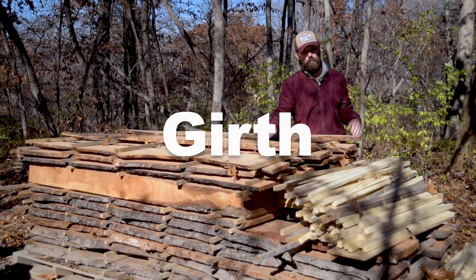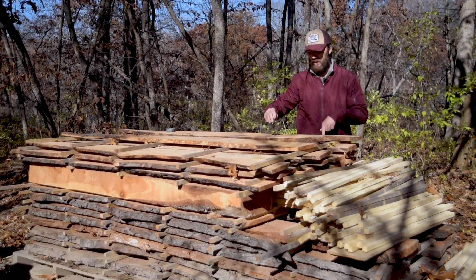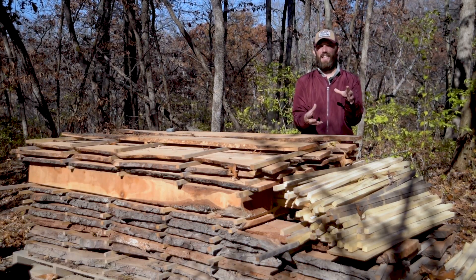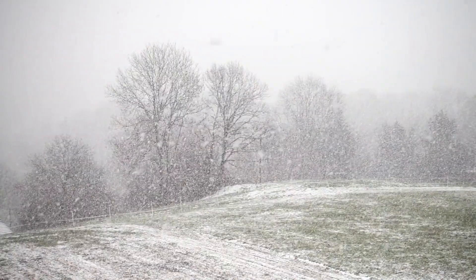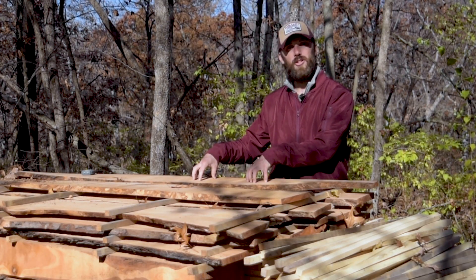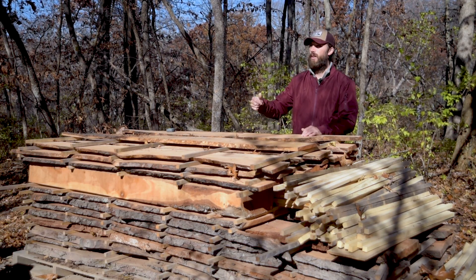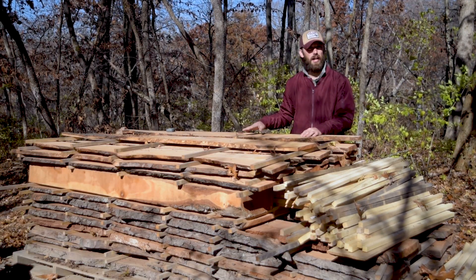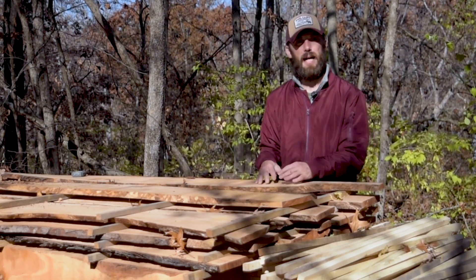The last variable is the thickness of the wood. These one-inch slabs are going to dry much faster than that five-inch slab. All the surfaces are drying in; the five-inch slab's outside might dry pretty quickly but the inside is going to take a lot longer. It's important to know that in winter here in the midwest, when it's below freezing, the water in the wood is frozen solid and almost no drying happens during those months. This is why fall is our best season — warm days around 60 degrees and windy and very dry, versus early spring where it's wet and cold, or winter where the wood's frozen.